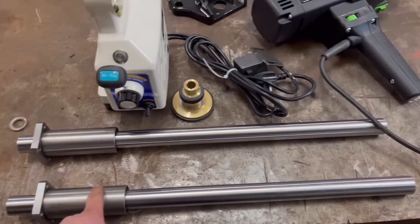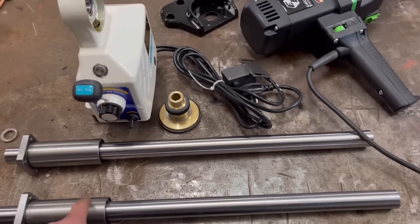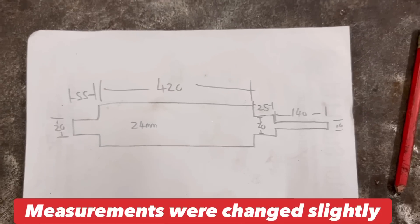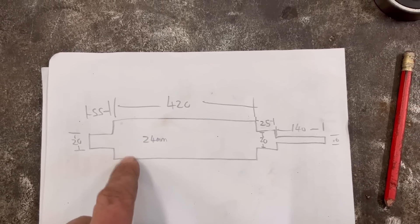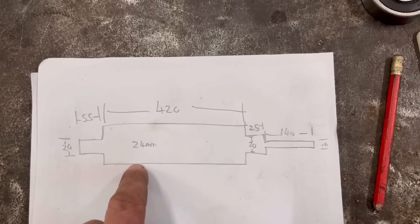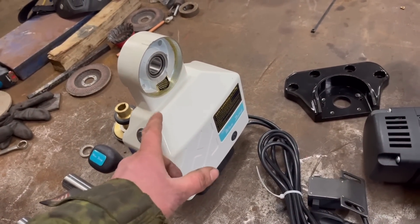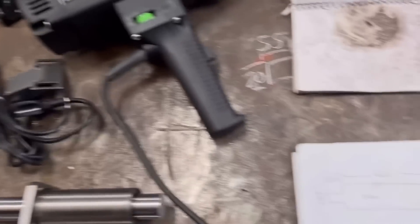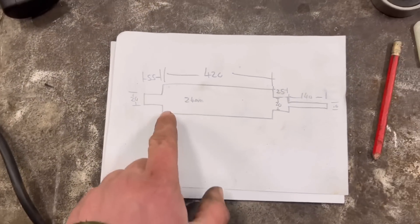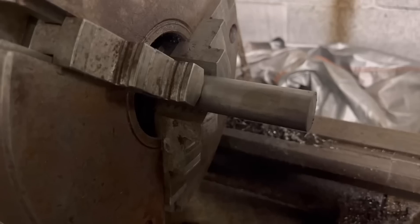The first job I think I'm going to do is make a lead screw — I'll have to cut some bar and make a lead screw. I want to make this first; I think this is going to be my lead screw. I'm going to use a 24mm thread and do it in fine pitch, because these seem to work better at high RPM — if you've got a coarse pitch, obviously you're going to have too much travel speed. So just there are the measurements, I'll start by making that.